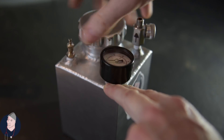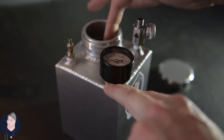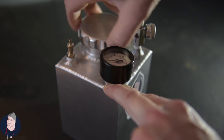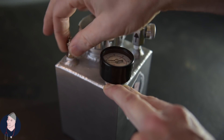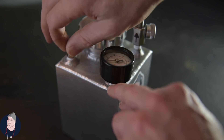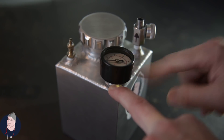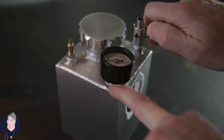There's an opening here which allows for inhibitors and chemicals of your choice to go directly into the seal at the top, so that you can keep it pressurized throughout the installation. On the left here is a metal Schrader valve — that's clearly where you add the pressure. And on the right hand side is the outlet that has a feed into the bottom of the vessel. It also has an on/off to stop the flow.